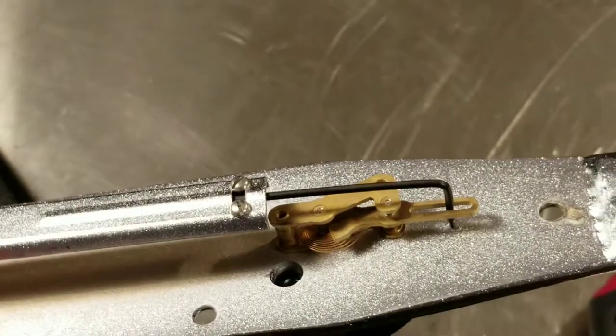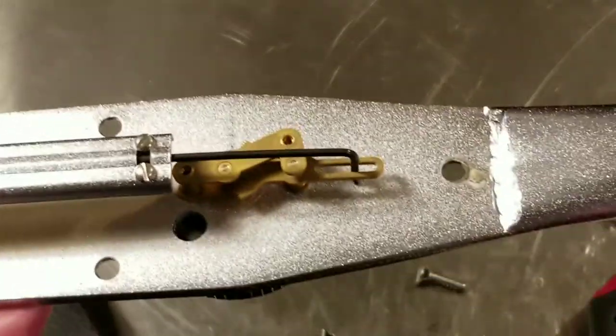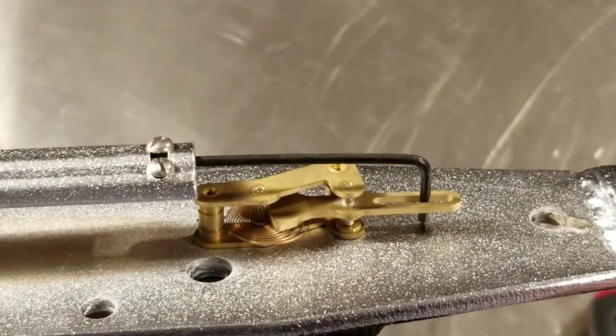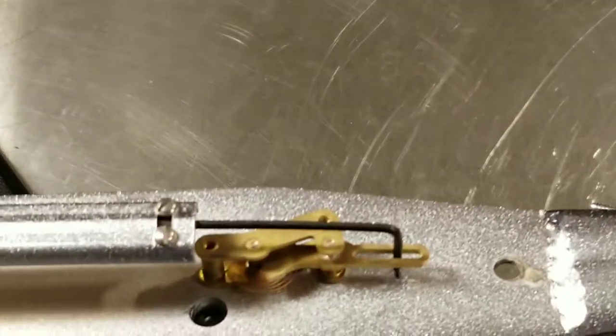You would run this directly against it, couple it to the digital torque wrench, go up to 50 foot-pounds, and see what the dial says, then just adjust this rod in or out until it reads that specific value. The rod connects to the back of the end link — it has a little pivot that works against the gear and a clock spring to rotate the dial.